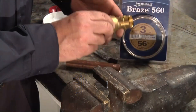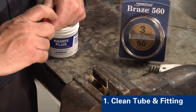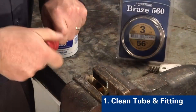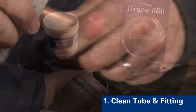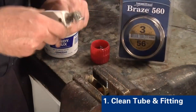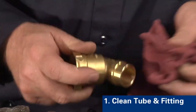Please note that the brazing sequence used for this alloy can be used for most of our other silver brazing alloys. Step one is to remove any temperature sensitive parts, then clean the tubing and fitting. Parts should be properly cut and reamed to remove burrs. Cleaning should be performed so that surface contaminants are removed without unwarranted loss of the base metals. Lightly roughen the tube ends and the fitting with wire brushes, steel wool, or fine grades of abrasive papers. Any residual particles in the joint surfaces should be avoided, and any residue remaining after mechanical cleaning must be removed.